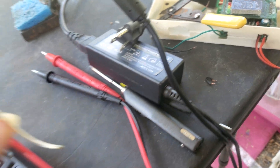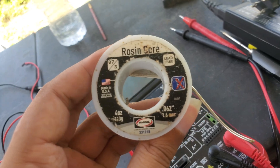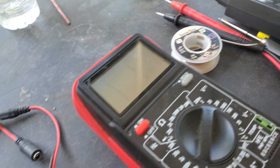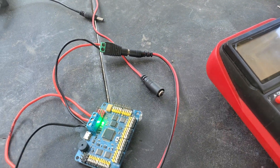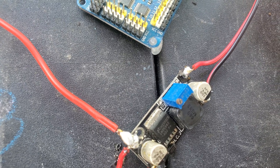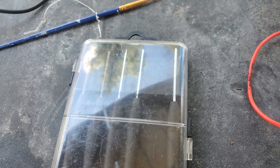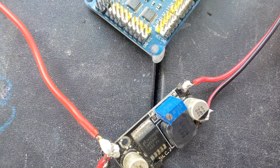This is my favorite soldering wire and I get it from Lowe's — it has rosin core built in and it solders really well. I have two of these. I use the small flathead screwdriver from a pack of small screwdrivers — Phillips and flatheads — to adjust the potentiometer on the voltage regulator from 12 volts to 5 volts.